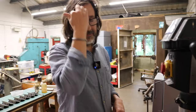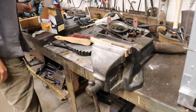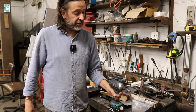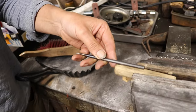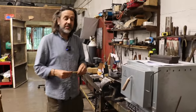Just one thing before we drill — if someone's watching and they don't have a drill press, what tips would you give? Well, you could have someone helping you to sight up and down while you sight left and right yourself. But if you're doing it freehand without a drill press, I'd recommend getting your blank slightly oversized, drilling the hole, and then using a piece of wooden dowel to give you an idea of where you've drilled, then shape the handle to fit your hole. That's probably the best pragmatic solution.